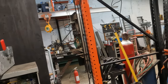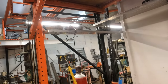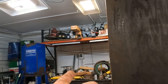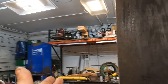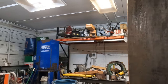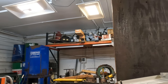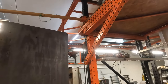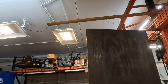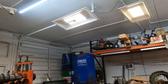And then, you know, the power going to that panel right there is so chintzy, man. The electric in here has an old FPE panel. They're outlawed. You can't even put them in, or if there's an issue, or if you buy a new home, they make you take those out and repanel the house, which this place needs. Basically this whole thing needs to be rewired, but this ain't my place, man. I got a quote for $1,600 or $1,800 for a new panel, and to run some 220 to this side. But why am I going to pay all that money for something that ain't mine?